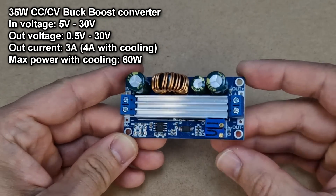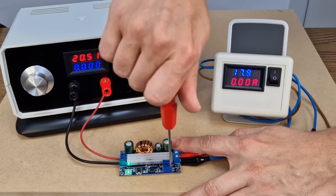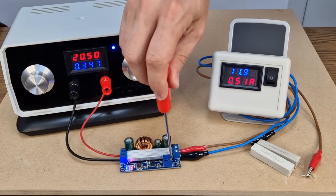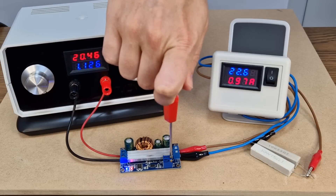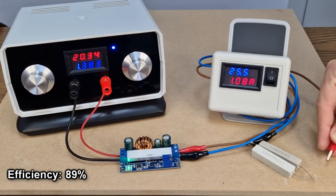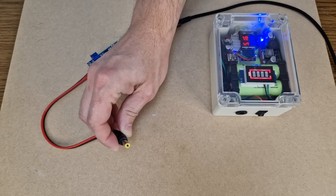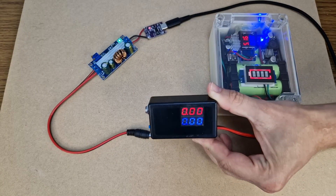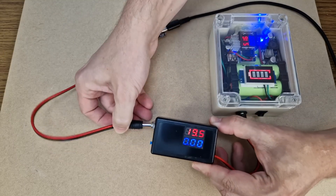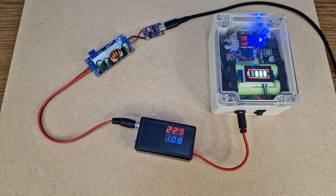For this battery I need to increase the voltage, so I will use a constant current constant voltage boost converter. I will set the output voltage to 25.4 volts, which is slightly above the maximum voltage of a 6S battery. Using another combination of ceramic resistors, I will set the maximum charging current without stressing the USB charger too much — 1.5 amps from the charger and 1 amp for the battery. Let's connect the PD board to the input of the converter. To charge the power bank I added a 5.5mm jack to the converter, and I'll use another volt-ammeter to measure the charging voltage and current. The 6S battery is discharged to 19.5 volts, and after connecting the charger, the battery voltage is increasing. You can see the LEDs light up on the battery level indicator according to the battery voltage.